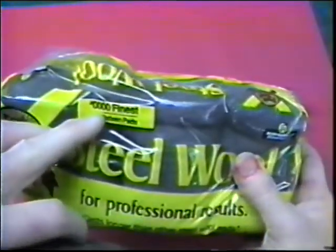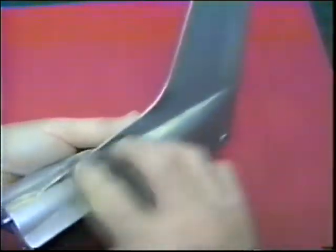You can always sand with steel wool. Steel wool basically works like sandpaper — this is 4-0 steel wool, the finest grade. Here's one area where I like steel wool a little better than sandpaper: when I want to do a spot touch-up, sandpaper tends to put an angle in there. But once I get the corner the way I like it, I can get in that corner with the steel wool because I really don't want to have to repaint the whole part. There's a little logic to this: a lot of people spend a lot of time doing things that don't matter. In the overall — let's say they're going to spend 100 hours on a finish, and they spend 30 of them on something that doesn't even matter or just duplicates effort. Where if you concentrate the effort on the areas you need to fix, you spend as much time as needed there.